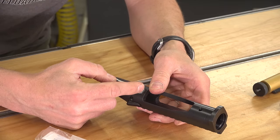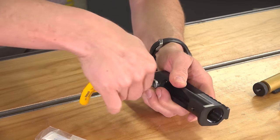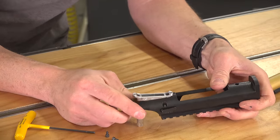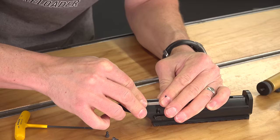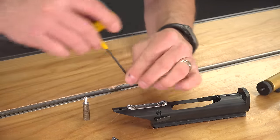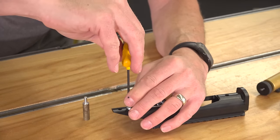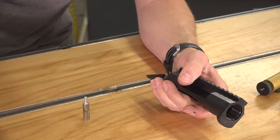The trigger hanger makes it really quick and easy to install a trigger. It's got a friction fit — you don't want any slop in trigger components. Using an aluminum punch, you can pull it out; there are pins you drop through the trigger and then press it back in. It has multiple orientations for different trigger length configurations. Later in this series I'm going to show a TriggerTech Diamond install — I really like that trigger.